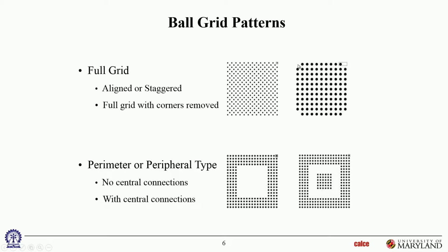Depending on the component design, sometimes it's the corner joint that's most likely to fail. Sometimes it's the one under the furthest corner of the die shadow that is most likely to fail. So for example, if in this component the die is sitting over here, it is possible, depending on the CTE and the compliance of the substrate, and depending on how big the die is, that this one may be at a higher risk of failure than that one. And I'm going to ask the students here to suggest why.